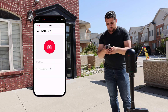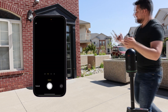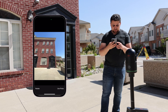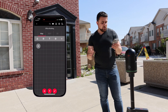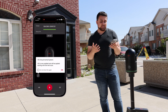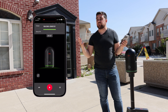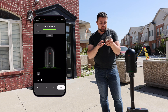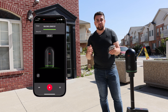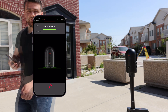I'm going to create a new job and call this 'office building.' I'll take a picture so I know where I am, then save. I'll select the bottom left icon to access my scanner settings. We're going to be collecting HDR pictures because it's pretty sunny out today, and our point density is going to be at the maximum density. This setup will take one minute and 37 seconds. I'll click start and get out of the way to let the scanner do its job.